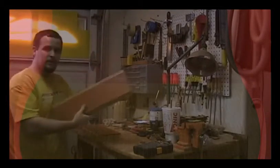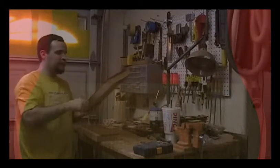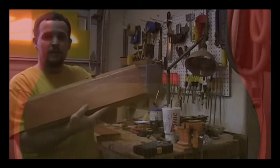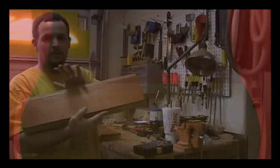What I'm going to do now is take these over to the bandsaw and cut just outside of the line, trace it all the way around. I'm going to try to save as much of this outer portion — as much of the cutoff as possible — because I'm going to come back and put that on it again when I clamp it together. I'm going to use it as a clamping caul so I have a nice straight edge.